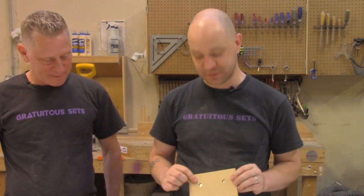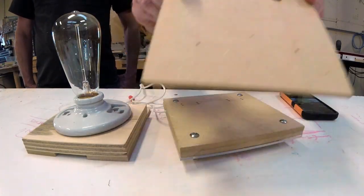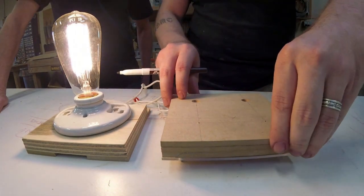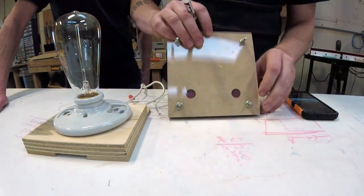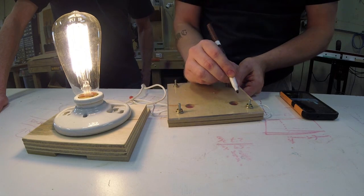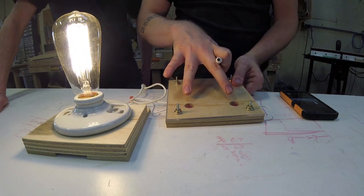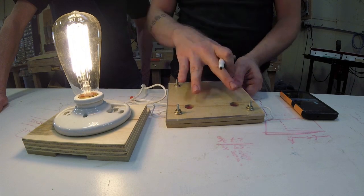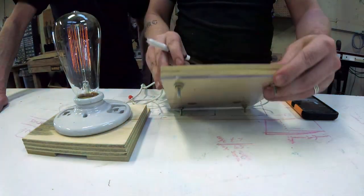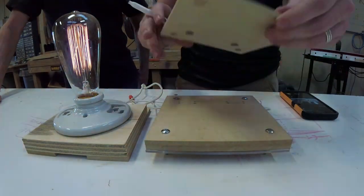Where we're doing this is magnets. We have some rare earth magnets embedded in this guy. That is pulling the magnets up into — gravity is doing it now instead of magnets. We have this wire comes in here, this guy comes in here, and another one goes back over there, basically giving us two switches. The magnet itself is serving as the contact on that switch. It is a series circuit — you have to have both of them and not just one of them.